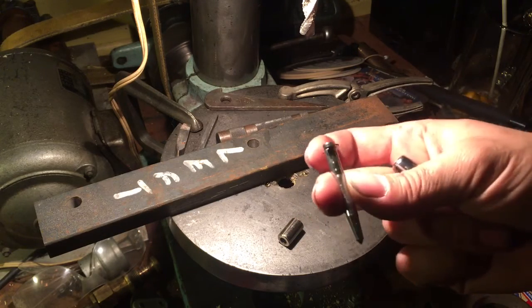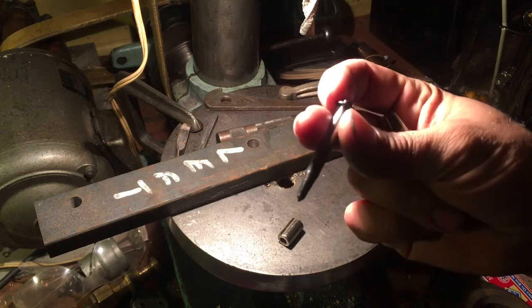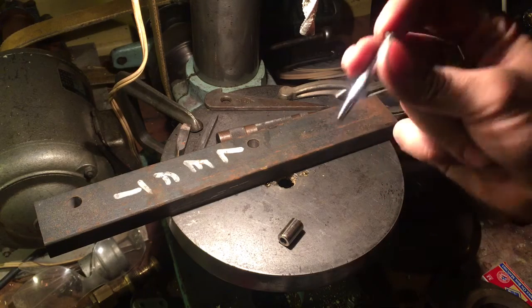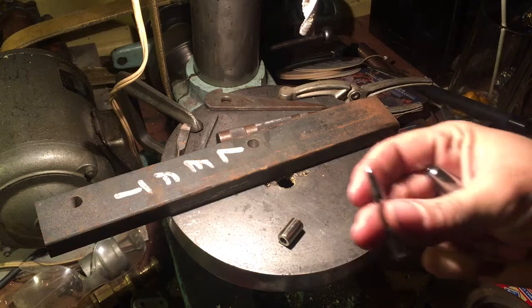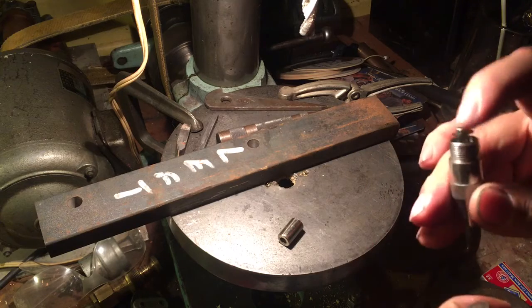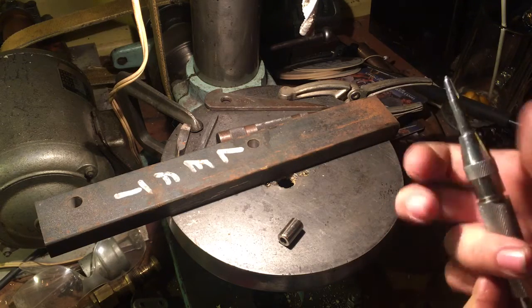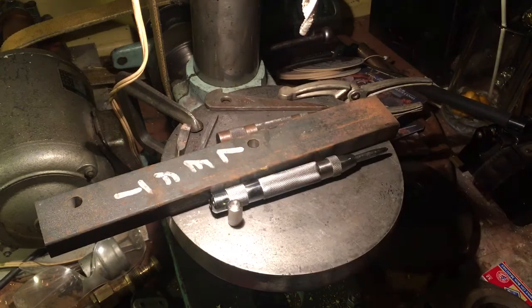What I'm thinking about doing is getting a piece of drill rod, turning a little groove in it, grinding the end to a point, and giving it a good heat treat — and I'll have something that really acts as a pretty good punch. The current tip is kind of blunted even though I haven't really used it that much. Anyway, it just goes back in there. If you haven't seen it, watch Tubal Cain's video on automatic punches — he explains how the whole thing works.